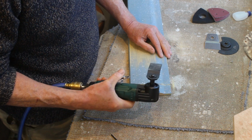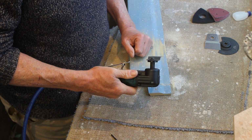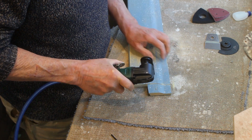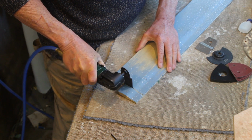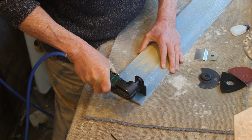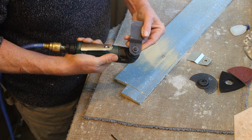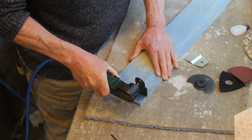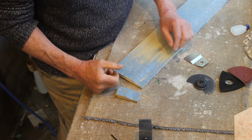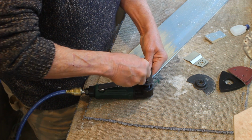What I'm going to try and do now, I'm going to cut this through, and I'm really going to put pressure on it. If I was to do that using an electric one, it would cut out. They have a thermal cutout, but you've not got that with this tool, so let's try it. Lots of vibration, lots of noise. And pressing hard doesn't speed it up at all. You're much better off just using the weight of the machine and letting it go like that. So that's the plunge saw. It works on timber.